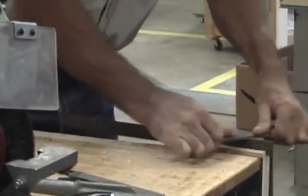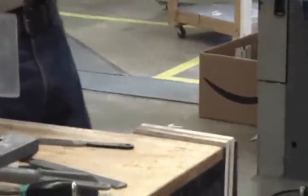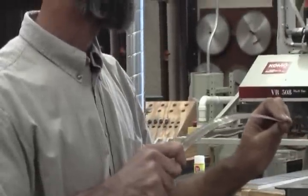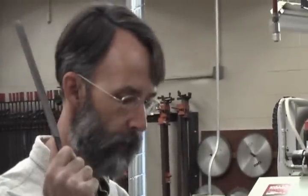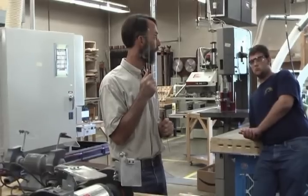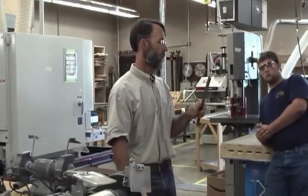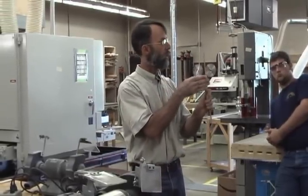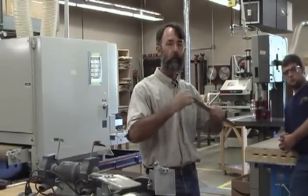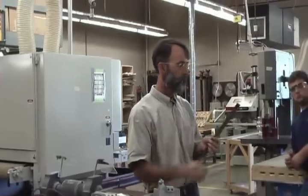What impresses me sometimes, I think about your kitchen knife at home, right? A nice long kitchen knife, beautiful edge on it, and you can do this with it. You think of a hard steel, not flexible, this is a hard steel. If I took it and smacked it hard enough on the edge of that thing, it'd break it right off. Sometimes you're using a file, you just drop it on the floor and it breaks. This is a hard steel too, but the tempering that they mentioned, this has been tempered, so the edges, the teeth are sharp, but the inside of the blade isn't. By being soft in the metal, you can flex and it doesn't break. That's actually harder to do than tempering this. But anyway, okay.